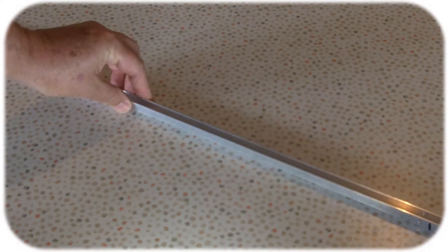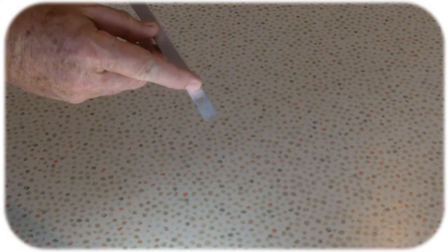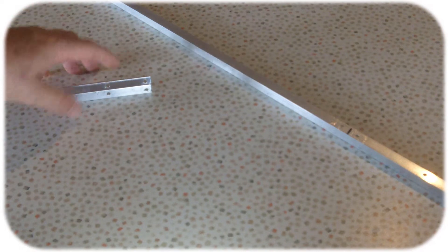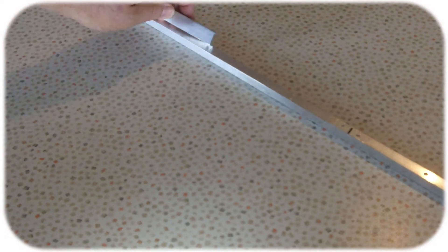After the tripod, you're going to need a piece of U-channel. This is aluminium channel which is 12 by 12 and only 1.5 mm thick. You could use a piece of timber, but I find this to be rigid, sturdy, and easy to drill holes through. You're also going to need another piece of U-channel — this one is larger, 15 mm compared to 12 mm, and the reason is that this one fits over that one.